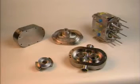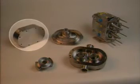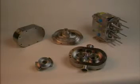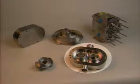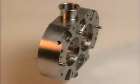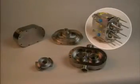Waukesha Cherry-Burrell offers versatile options with the Universal 2 fluid head assembly. These include vented covers for pressure relief and jacketed covers to maintain product temperatures, CIP options including flat body profile for free draining capability and specially drilled CIP rotors and body, flush taps for double mechanical seals, and stainless steel gear cases.